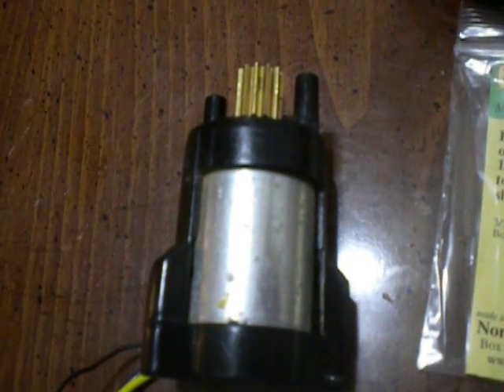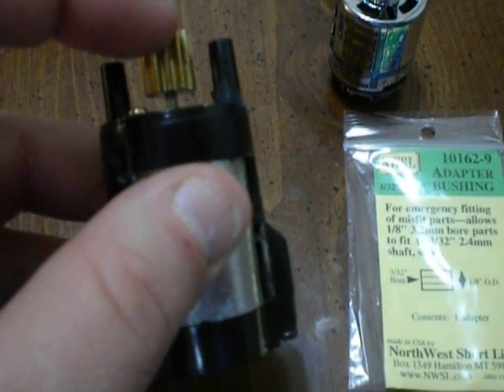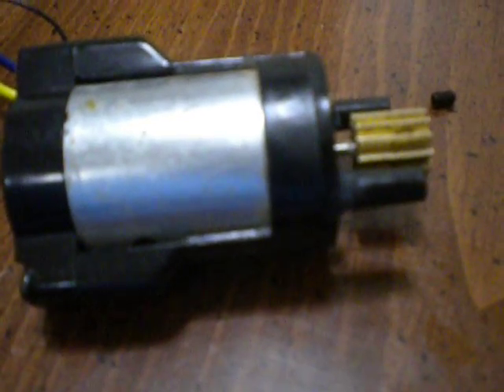What you've got to remember is you want the original pinion position, because you're putting it in your Nikko Dictator or Radio Shack Black Phantom — they're all the same thing. You want to make sure your pinion end is the right length, measuring from the rear of the motor case to the front of the pinion. That length is approximately 66.9 to 70 millimeters.